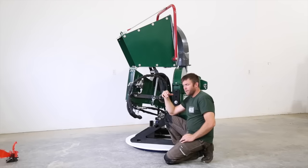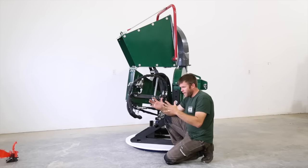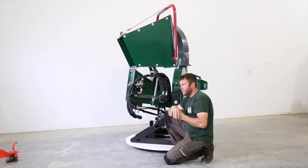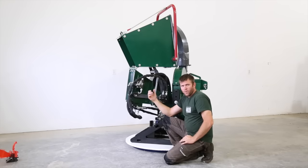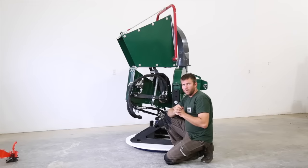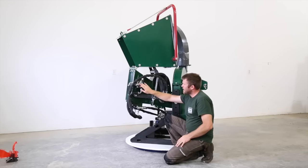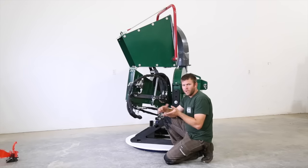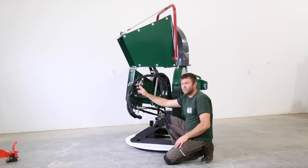This is an 8-inch chipper. The opening is 8x8. The infeed roller will grab 8-inch material and push it. But you do need a lot of horsepower to chip 8 inches of solid wood. This allows people with lower horsepower to chip larger things. So when we say you can run 30 horsepower to 100 horsepower, 30 horsepower won't chip 8-inch material at full speed.